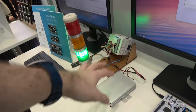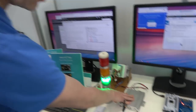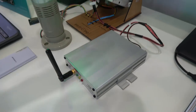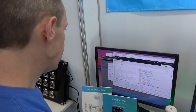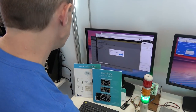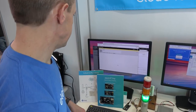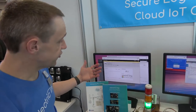Over here we're showing off some things using PLCs. There's a PLC interfaced via an input through a Fieldbus gateway running Modbus RTU. We're sending the data to Microsoft IoT Central. This is showing how our cloud side integrates with Azure — it's really the fastest, easiest, most secure way to get data into the Azure backend.